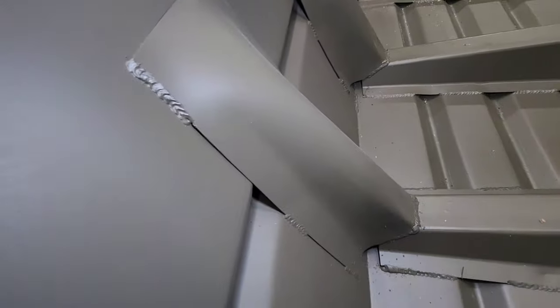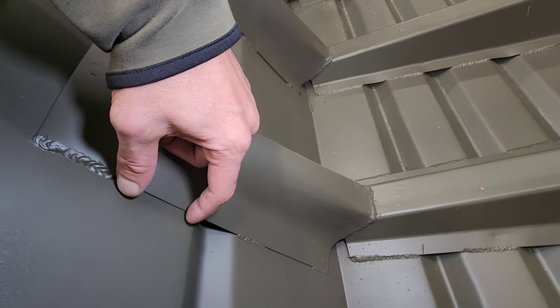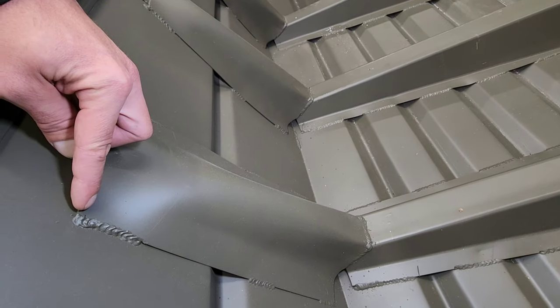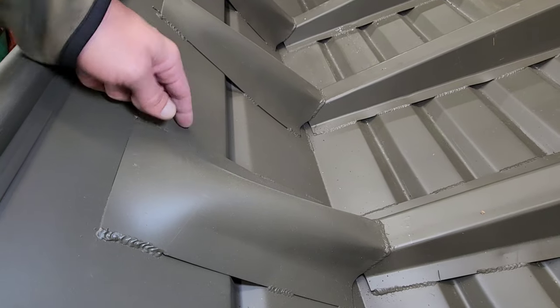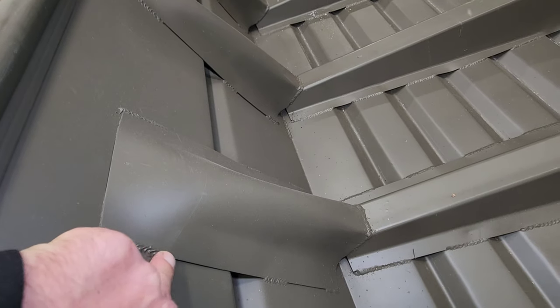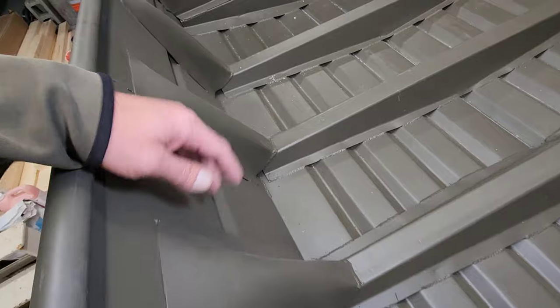But it's not a big deal because look, these ribs, they're only welded at the top. So we're just going to basically come back right here. We're going to weld this down lower and just cut this off right here, rip that out. And the way I do this so I don't cut into the hull, I'll just cut into this weld with a cutting wheel on both sides. Then I'll just take a flathead screwdriver. I'll squeeze it right in this side right here where I made my cut. Hammer it in there one time and pop this thing off in one piece. It comes off super easy.